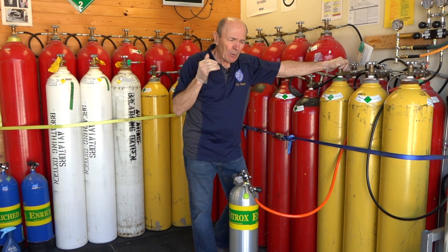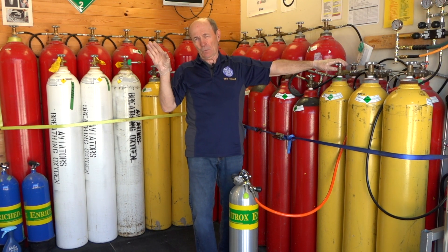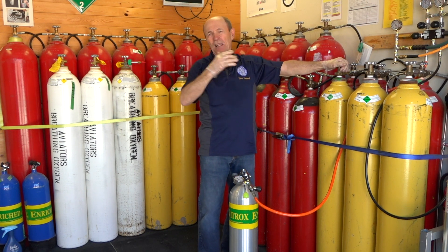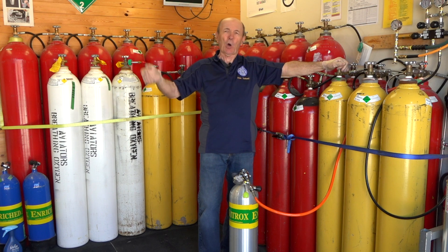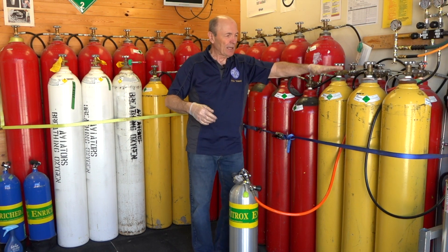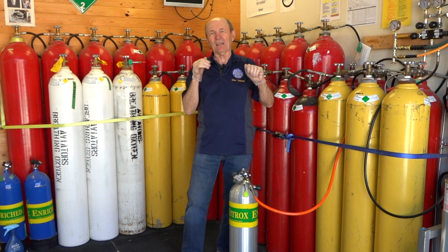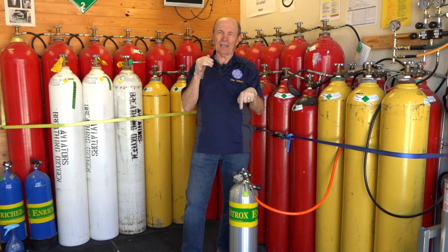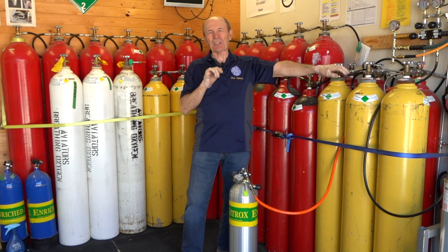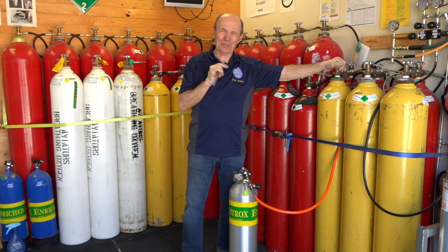You might say, well, why don't you get a whole bunch of bottles, hook them all together into one big system, fill it with a compressor for a few hours, and then fill my tank and a whole bunch of other tanks? That won't work either, because once again, if the bottles are at 3,000 PSI and I fill your tank, now all those bottles are down to 2,700. Nobody else can get a fill unless I run the compressor.